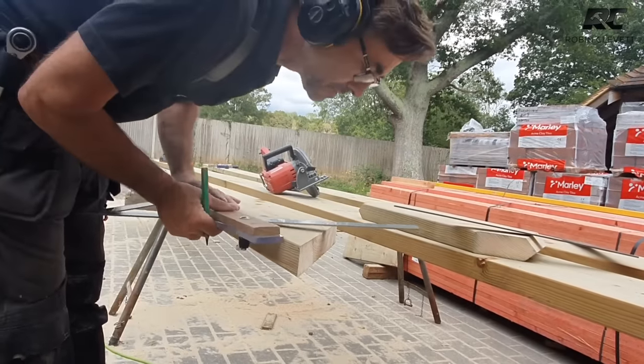That's it — that's ready to fit. Make sure all your cuts are the right way around, otherwise after all that time making a scarf joint you only get one crack at this. I'm going to turn it over, find the point, and careful of the scarf. I'll drop my bottom in and aim it towards where it's got to go.